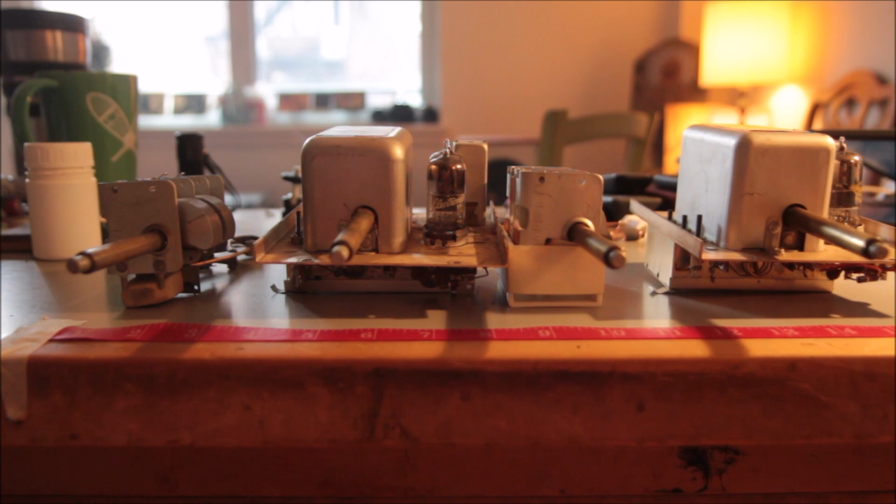So it needs to go to a diversity tuner of some sort that can take the first intermediate frequency signal, which is what this thing puts out, right? The first intermediate frequency. So that first IF is basically what this front end is delivering, and you can see, well, right there in the very center of the picture is the 10.7 megahertz IF transformer that is IF1 in the circuit.